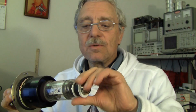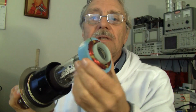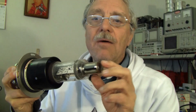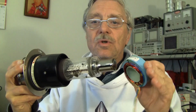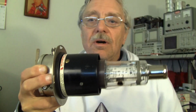Currently, I use a small adapter that I made that keeps the yoke from rattling around. The final enclosure will actually support the yoke itself, and that won't be necessary. So we need to support the yoke, cover the tube and block light, and cover up some of these exposed high voltage contacts, which would cause poor old Labguy a bad day if he was to touch them.